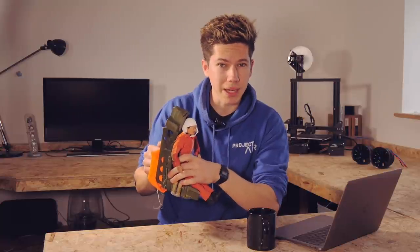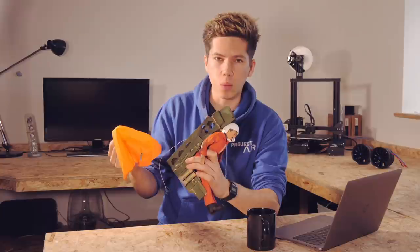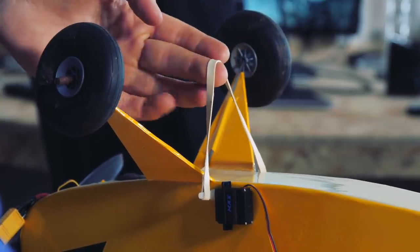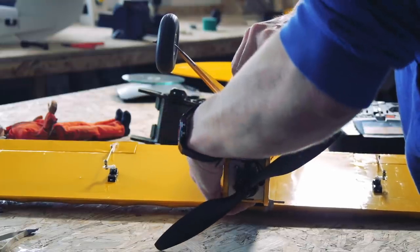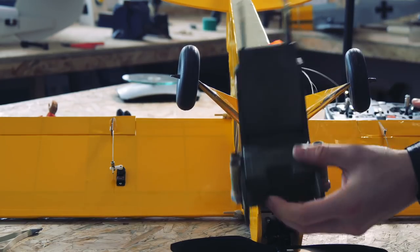I'm developing this project step by step and test by test as a sort of evolutionary process. Before jumping ahead I wanted to give the drogue parachute a test to see if it works in its own right. This involved making a quick release mechanism on the underside of a balsa basic supercub that I had lying around my workshop. Next I could travel up to the test flight field to see whether the tether cord system would work in the air.